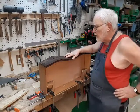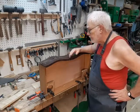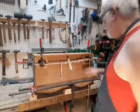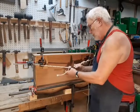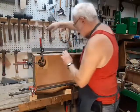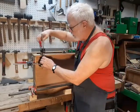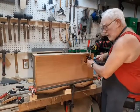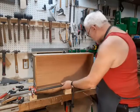That's not too bad for a drawer that spent way too much time underwater. All I have to do now is take this all back apart, glue it, clamp it back again, and I'll be almost done with this project. One of the problems with repairing furniture that's gotten wet is that when the wood gets wet it changes shape, and when it dries out it doesn't go back to its original shape. So each of these boards are actually cupped, and when I go to put this back in the cabinet it came out of, I'm probably going to have to do quite a bit of planing and shaving to get it back to where it fits in the original.